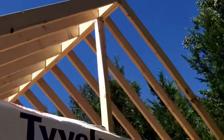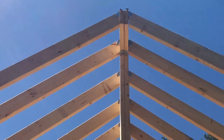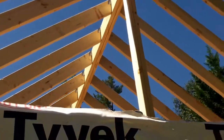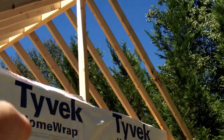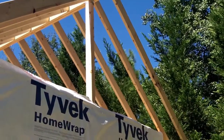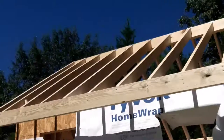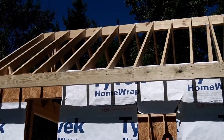I need to put glue up at the top where the rafters meet the ridge beam, because there's a little gap — I couldn't get it perfect, so glue will suffice to handle the gap. What I'm going to work on now is this triangle at the gable end — the wall needs to keep going up until it meets the roof, so I'm going to put the studs in to complete that triangle. Then I'm hoping to get some sheathing up on the roof. That'll be exciting — the roof will be well underway to being done.